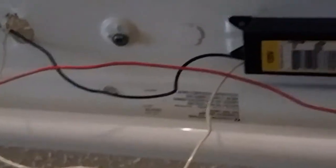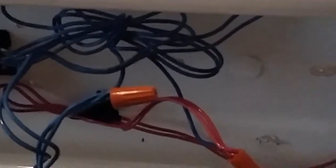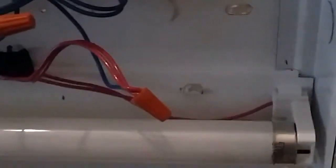Hopefully the lights are going to turn on, we'll see. The new one has a red wire, two blue wires coming from it, and then also has your power wires — your black and your white. Now it only has three wires. One of your blue wires will connect to the double blue wire going over to this light over here.